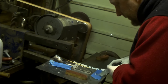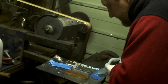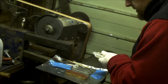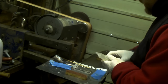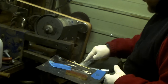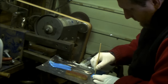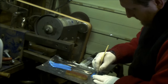As I say, just putting it out like this, you can tell you've got such a similar volume of each one. Then I pull it back to create a negative pressure, otherwise the damn thing will just keep delivering. And then replace that on the plastic. You get your applicator and mix it up really well, making sure you've gone to all the edges to get each corresponding differing pool of glue mixed in with the other side.